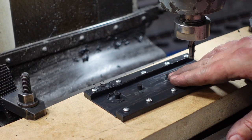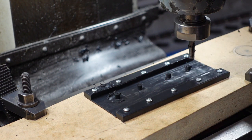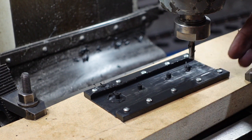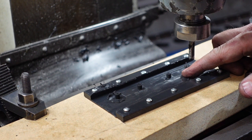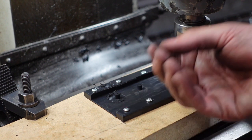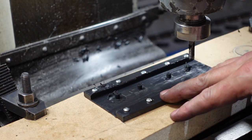All the bosses are done now. I'm doing feature by feature just because getting the radius set spot on is a pain in the neck with this thing. At the moment I'm just using a dial indicator on a couple of spots, winding it back and forth, trial and error sort of thing. But they're done. Now I'm actually using a router bit here with straight flutes, and the reason for that is that a normal milling cutter tends to pull into the material a little bit. I was concerned that with softer material like this plastic, particularly with only two millimetres of thickness here, I'd be pulling into it and possibly cutting a hole into my plastic. So I'm using a straight flute cutter so it doesn't try and pull up.